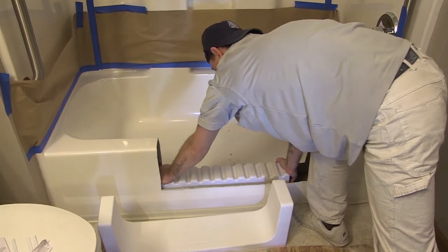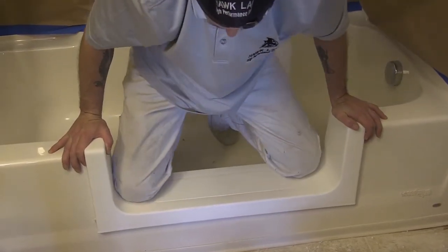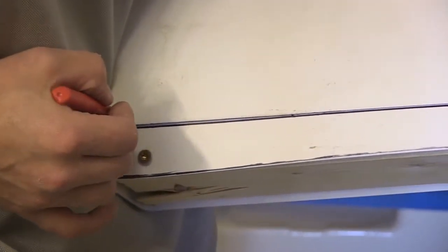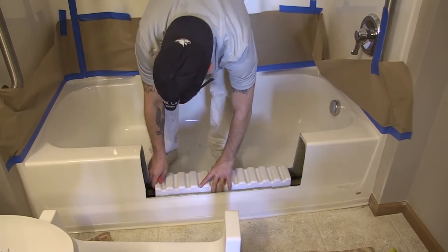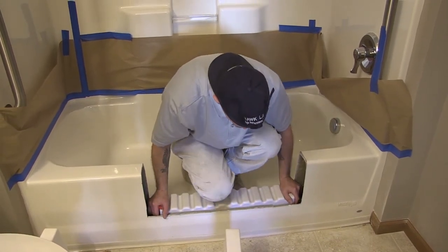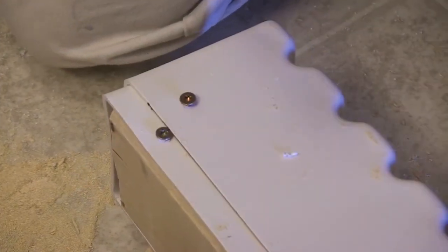Place the large support box into the channel and over the top of the small box. Place the SureStep product into position and compress it downward to determine the proper height and placement for the support box structure. Once the SureStep product is properly supported, remove the step and support box structure and mark both ends of the small support box where the large box is compressed, labeling the markings 'left' and 'right.' Uncompress the two support boxes and apply adhesive around the perimeter of the large box. Compress them back together to the appropriate markings, place the structure back into the channel, and insert the SureStep product to verify proper placement. Secure both sides of the support structure by placing two screws in each side.